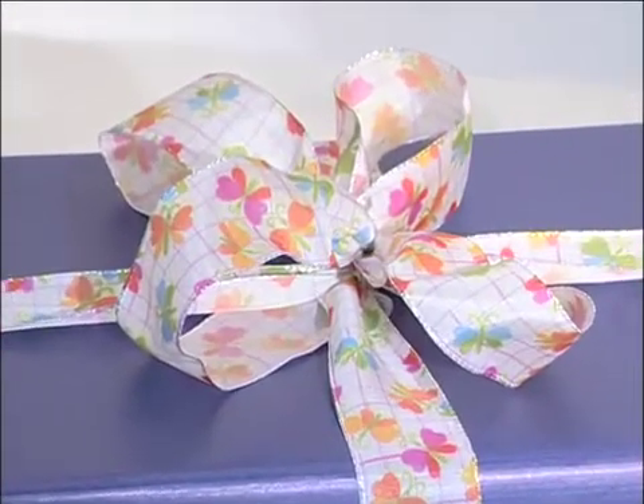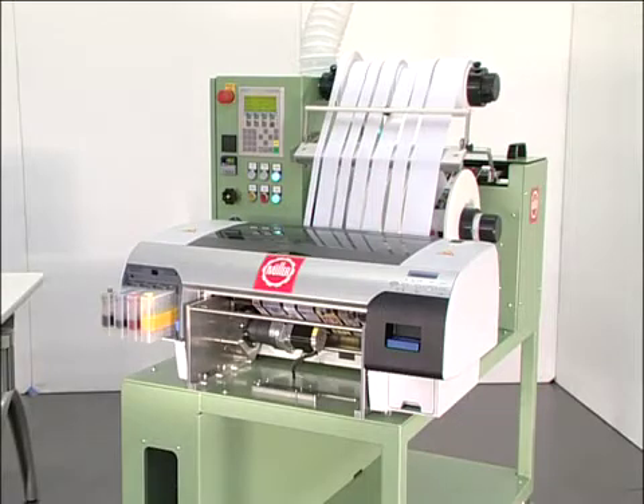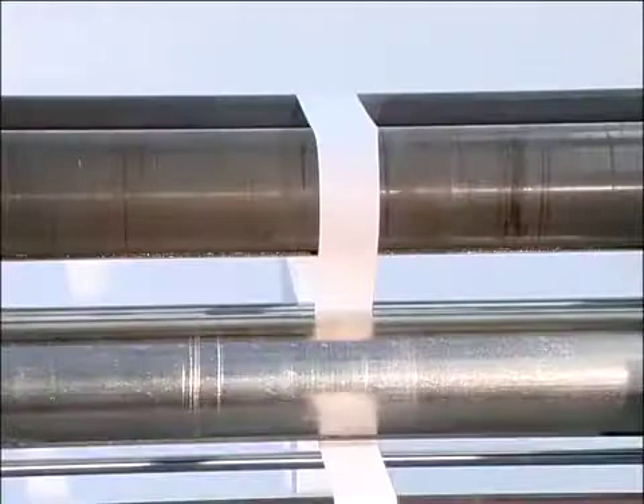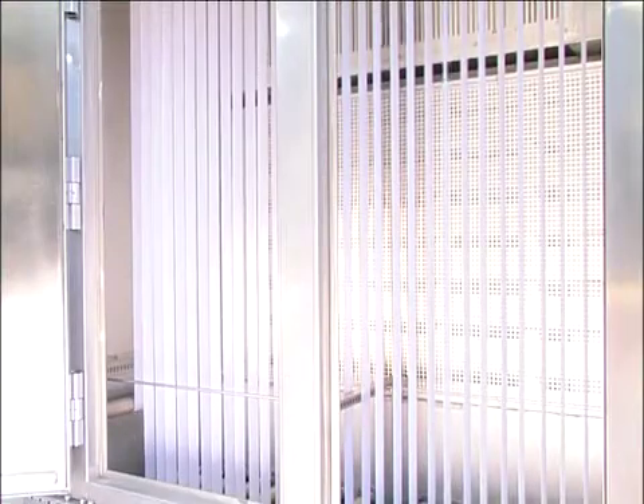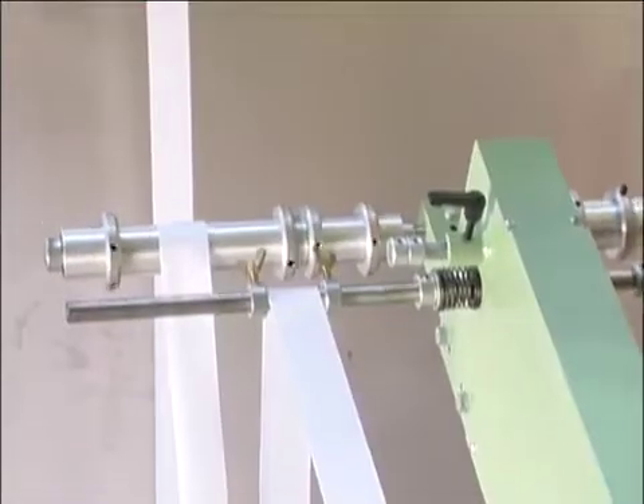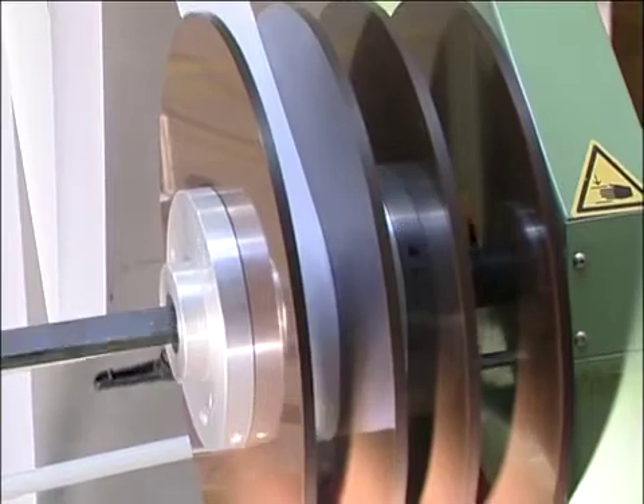The narrow fabric printing process consists of two phases comprised by pretreatment and actual printing. The initial phase involves thermosetting using a recommended temperature which corresponds with the fibers used. Subsequent narrow fabric finishing using an agent that matches the ink ensures the fastness of the printed image. Realistic colors and sharp contours are important indicators of good textile printing quality. Moreover, should special service characteristics be required, such as a high sheen, this is secured by means of extra calendaring.